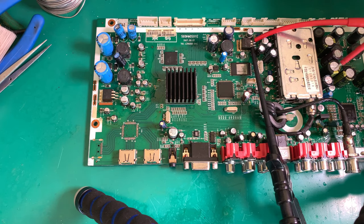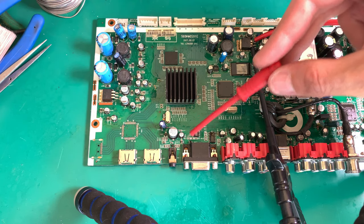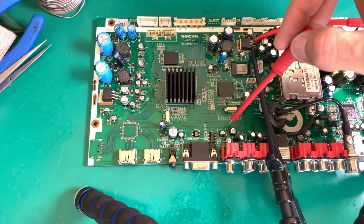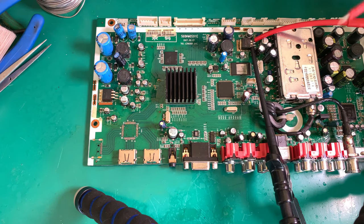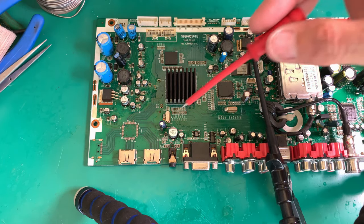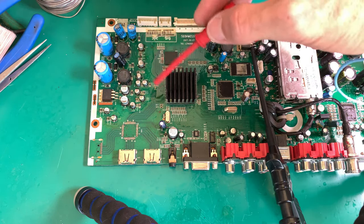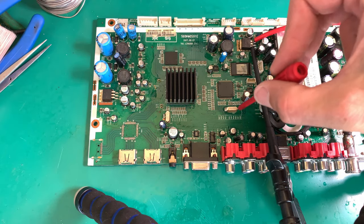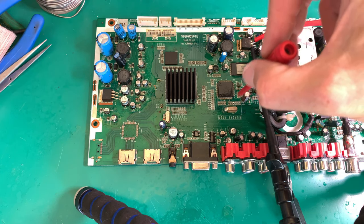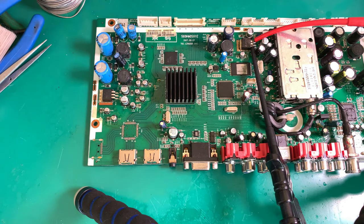Because they were quite common components, you'd notice the footprints for the 47 microfarad capacitors, the 100 microfarads, 22s, etc. They're all roughly the same, and these were quite uniform throughout. So I took a gamble and said, okay, that footprint was the same as another 47 down here, another 47 up here, so that is going to be a 47 microfarad capacitor. I also looked at over here, it's a similar rating. So that's really how I got to it. It wasn't rocket science or anything.